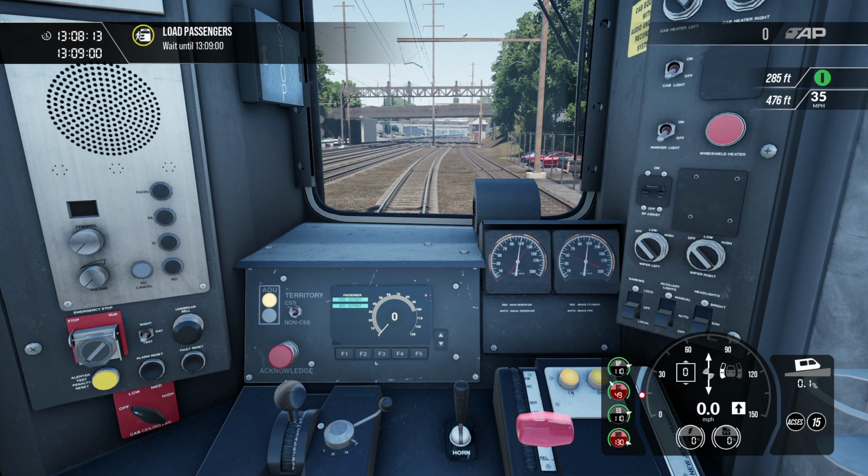This train technically would have come from Morrisville Yard, so usually they wouldn't do a rolling brake test here unless a new engineer was taking over the train. That being said, I am going to do one anyway, just because I want to make sure everything is working. So, to repeat, a rolling brake test consists of taking a 12-pound reduction, watching your speed start to fall, going to hold to test out the EP function, verifying EP function is good, then going to release. And again, speed should fall at least 3 miles an hour during the rolling brake test. Alright, so we are all set to go.